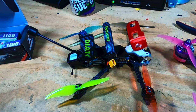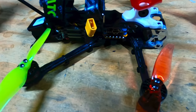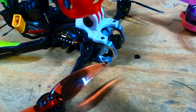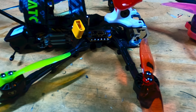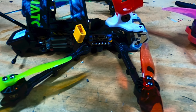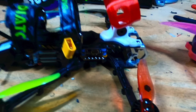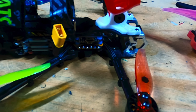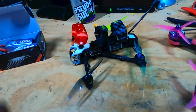So now I have 21 drones including this bad boy. This is a Diatone frame called the LR 4-inch, and I have the Caddx Polar HD system in here — real clear, real beautiful camera. The flight controller is a BetaFlight F4, and I think it's a 30-amp 4-in-1 ESC. Anyway, this thing was built for long-range efficiency.